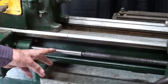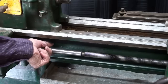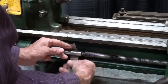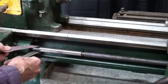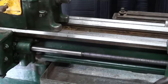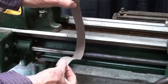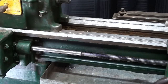I'm in the process of cleaning up the lead screw, and I've already polished a bit the unthreaded portion. There was green paint on here and it was just kind of tarnished, and I did it with a strip of emery cloth - and that works very well. When you use this, do not wrap it around your fingers. Hold it with the end so it can easily be pulled out of your hands and not hurt your fingers.